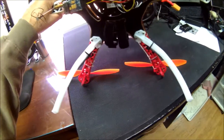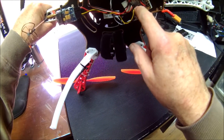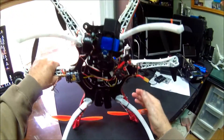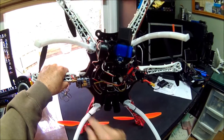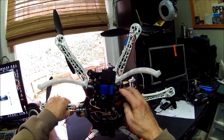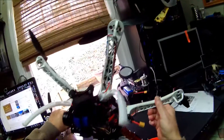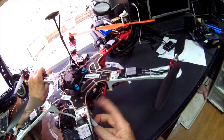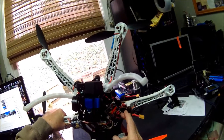The video transmitter board is a circuit board intended for a racing copter with first-person view, so all the video is filtered through the board. It's got a 5-volt and a 12-volt BEC. The 12-volt runs the LEDs, the transmitter, and the gimbal — though the gimbal is running off battery right now since it's got its own power regulator.